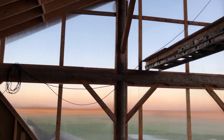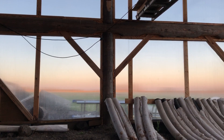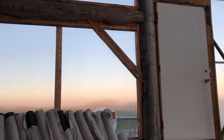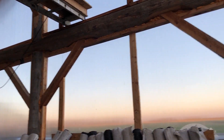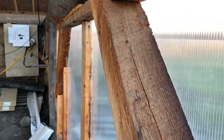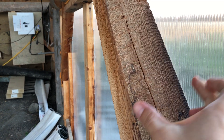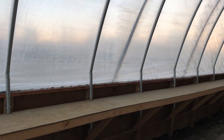This whole wall here — it's beautiful light at this time of night; it's mid to late May 2021 — is polycarbonate, just the cheapest twin-wall five-millimeter I could get. I'm thinking at some point I may put a second layer of polycarbonate on this side with a dead air space in the middle between the beams, which would allow for even better insulative value. This wall has been a bit of a pain — the wiggle wire with the strong winds has pulled out a few times, and the film is now about five years old so it'll need to be replaced in the next couple of years.